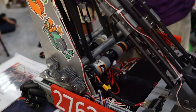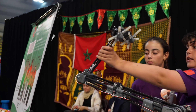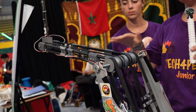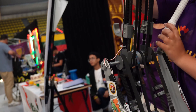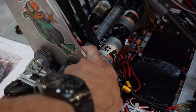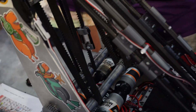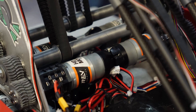When you move the arm, it still goes up. For coding we use a PID system, so it's really easy to go to position — though we can't go all the way back because of size limitations, so we always play in front. This is a coaxial virtual four-bar: this side spins and actually pivots the main arm around itself. Most of our movement is between here and the top basket.